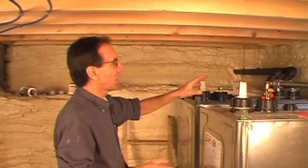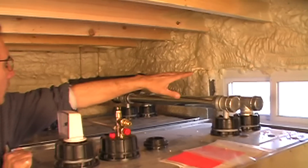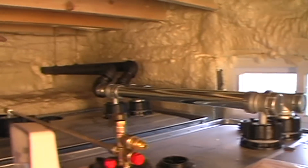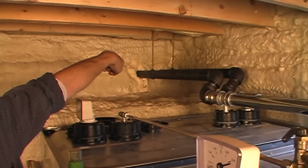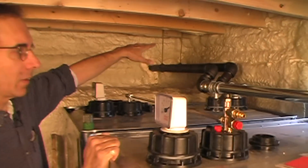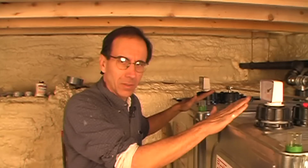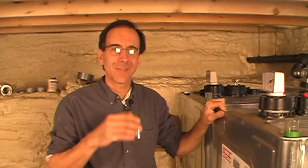We've got all the lines hooked up now, and you can see in the back, as I mentioned before, we have the fill pipe, which is here, and we have the vent pipe, which is there, and they go right out into 2-inch black iron pipe for the oil delivery man, man or woman, to do his or her thing. We got the tanks filled, so we are almost ready to do stuff here.